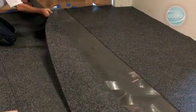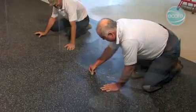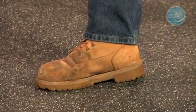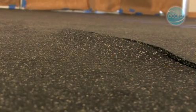After adhesive is applied to the substrate, the material will be worked back to eliminate the overlap. This procedure will leave tight seams and eliminate any gaps. Care should be taken to not overcompress the seam. Overcompressed seams will cause peaking.